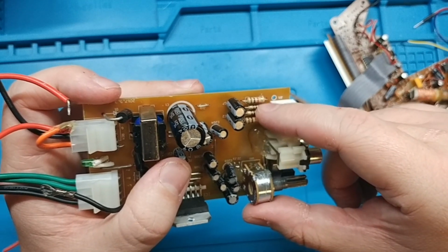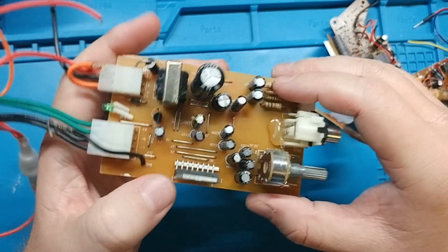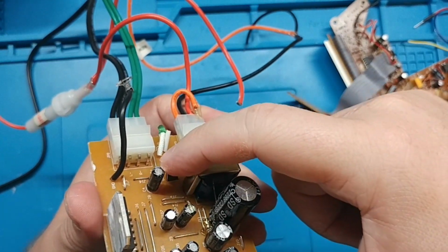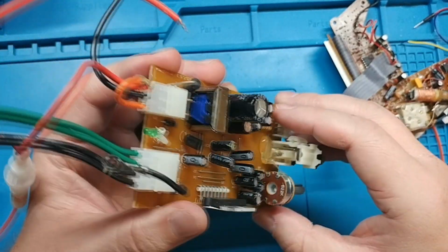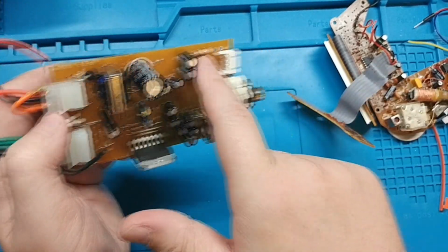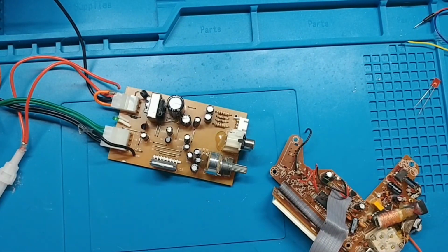We might double them up to make 200 ohms. We'll see what our power draw is like. And then we also have another transistor right here. And this one I did look up, and it is an NPN. It's a big one, but it should still operate at the voltages that we're trying to do. So transistor, resistors, and diodes, that's everything we need to make our relay module.